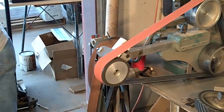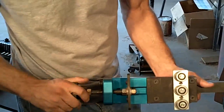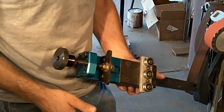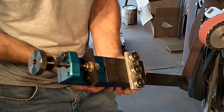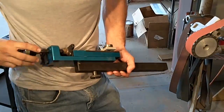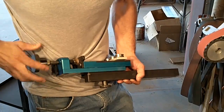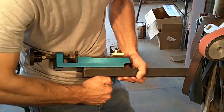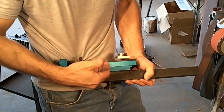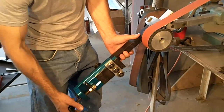The first part of the surface grinding attachment is the main for your in and out. Right here is where a dial indicator would attach. This is your slide tension — you can actually loosen up your slide to free-spin for adjustment, and then snug it down before you feed. That provides tension so you don't have backlash to worry about.